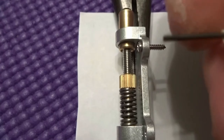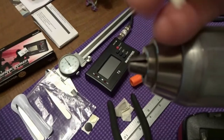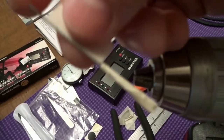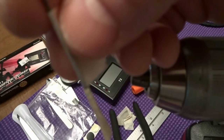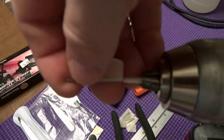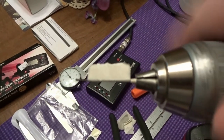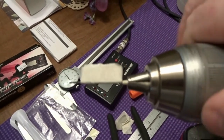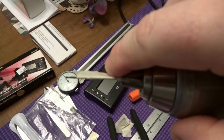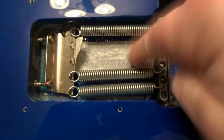My chuck wasn't going to hold a 46-thousandth drill bit properly, so wrap some tape around the bit shank to make it bigger so the chuck can grip it. You can also use collets for this, but for what we're doing here it's fine. Tighten it up — the goal is just to keep the drill bit from spinning.